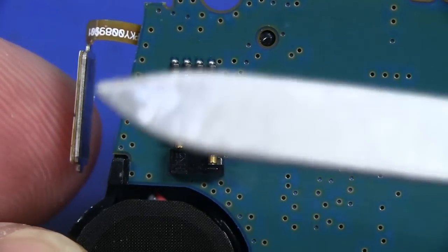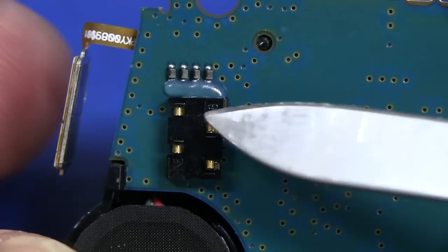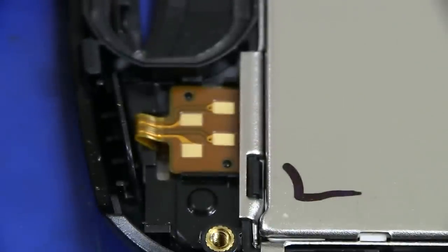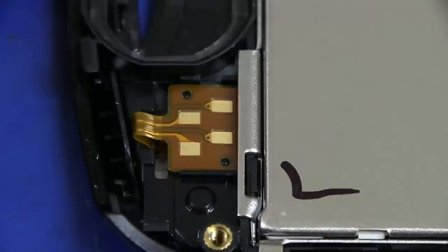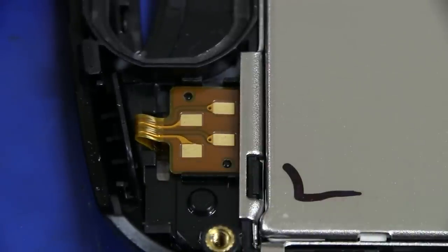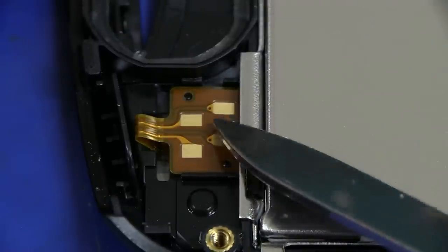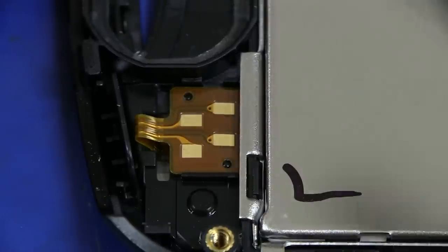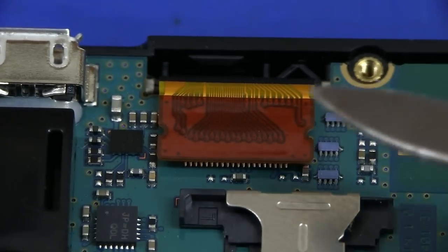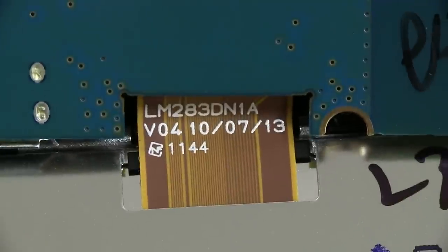I'm surprised that they've actually sprung for the extra little flat flex cable going over to the main board like that — they're wasting half a cent there in the manufacturing cost. Maybe could have optimized that one out if they tried a bit harder. And if I flip the board out here, just near the power tactile button, you can see these four contacts on the bottom here — they actually go down inside the unit. And you can see that's obviously the flat flex membrane going in there and driving the backlight for the screen.